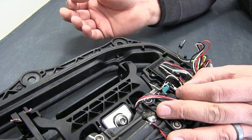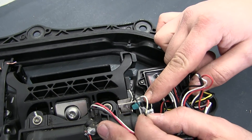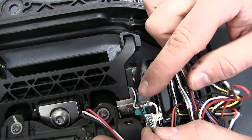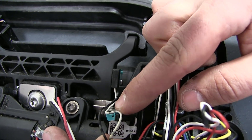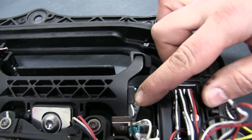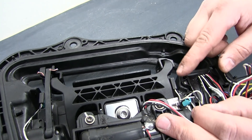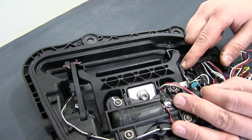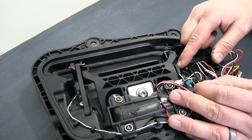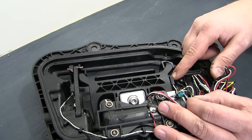There are a couple of ways to fix this. First, if it's broken down the line, the easiest way is to pull it out, clean it up, solder it, and put it back in and it should work. If it's broken right out of the switch, you may be able to repair it at the switch, or you can buy a replacement micro switch from Digikey and a few other sources — linked in the description — for about three or four bucks a piece.